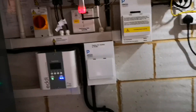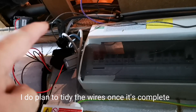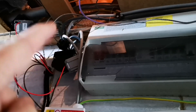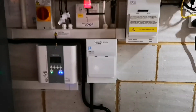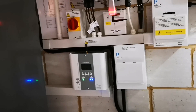And both the battery and the My Energy devices will report the right numbers. Now it gets confusing — is my system working or is it not working as it is? And it is working. That's because back up there amongst all these wires is yet another CT clip that's on the AC side before the consumer unit. So both the battery and the My Energy devices are monitoring the cables — that direction goes off to the meter cupboard, that's the main supply, and this direction goes to the house and the consumer unit. So monitoring the CT clips here is monitoring import and export correctly. It's making the right decisions on whether to charge the car or heat the hot water based on whether there is export, but it doesn't know how much it can charge or how much it can put into the hot water because it doesn't know how much solar there is correctly — not if the battery is taking some.